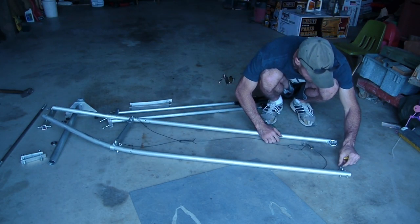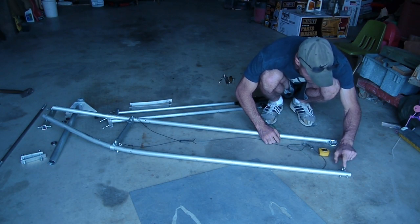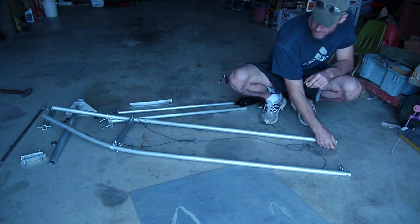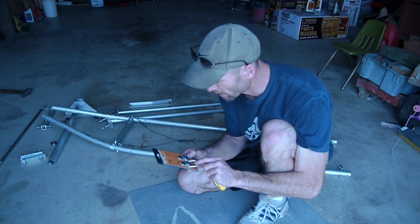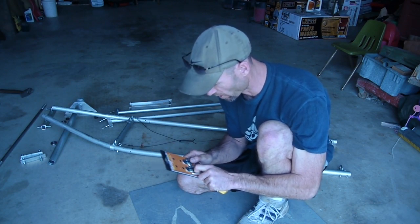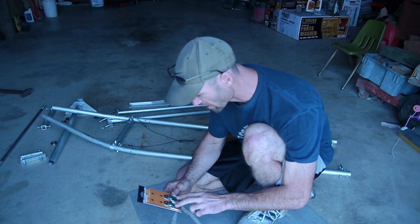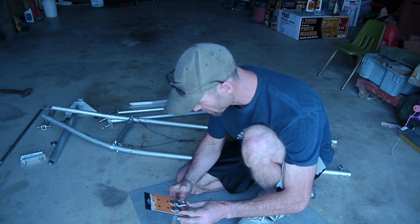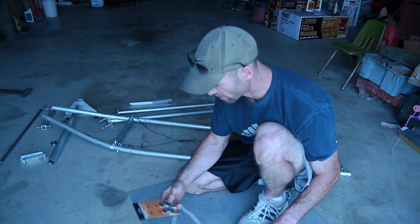This portion here has these little clips with quarter-inch bolts going in. This can clip into the side of your harness — a standard harness. I used these to clip into the harness; they were about four bucks at Home Depot and they've got a 300-pound load limit. You're not going to have much load on them — it's just to hold it to the sides of your harness. I'm going to try several different ways to clip it in, close to other powered harnesses I've used, before I fly it, and then I'll explain it on the video where I actually fly this harness.